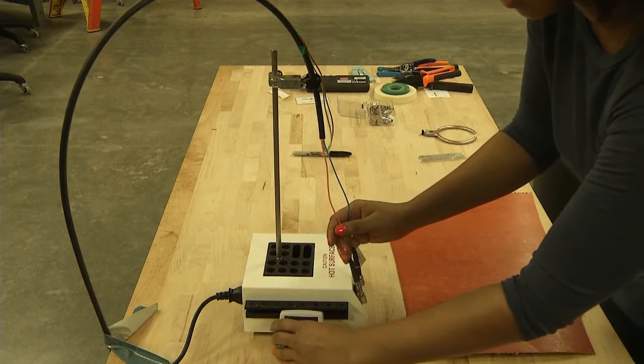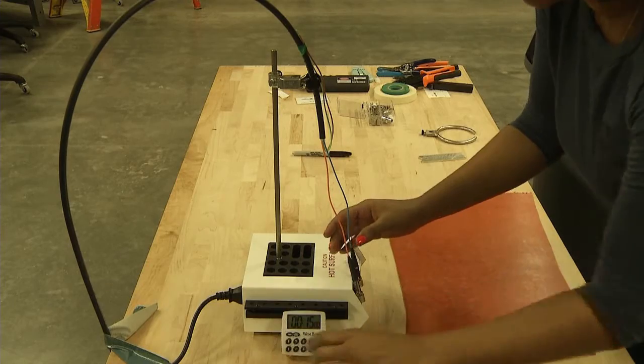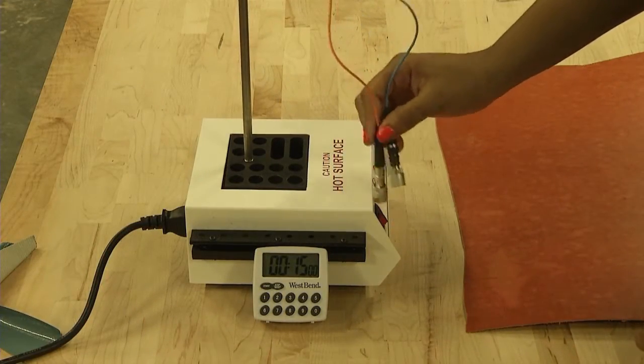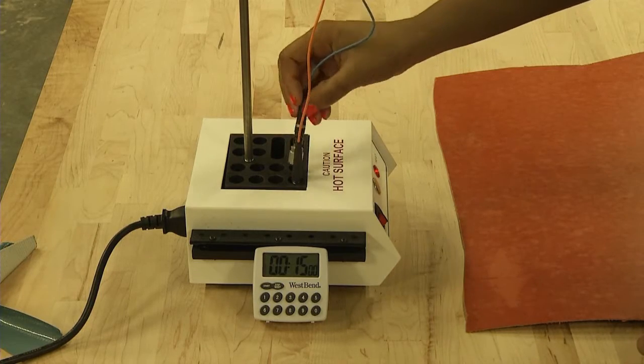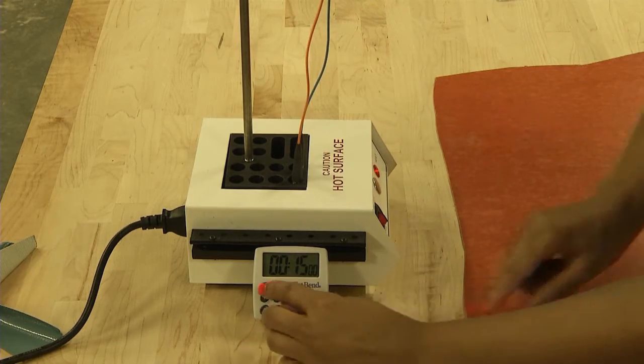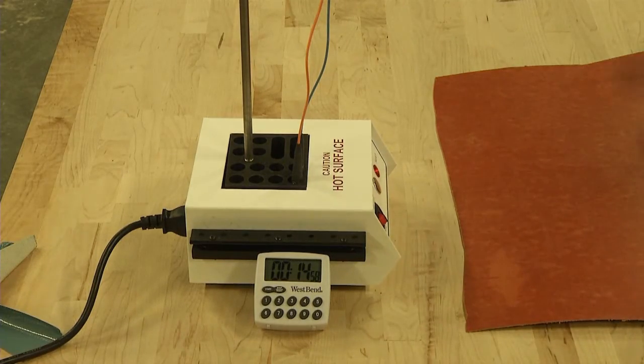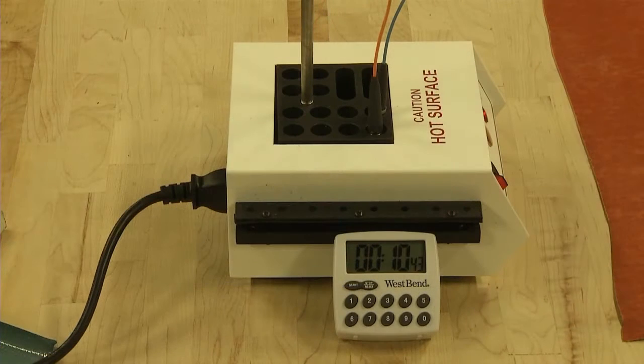Turn the curing oven on before the connector is in place so that it reaches the proper temperature, approximately 20 minutes. Place the cure adapter with the connector in the curing oven and position the OFCC vertically over the oven. Cure the epoxy for a minimum of 10 minutes and a maximum of 30 minutes.